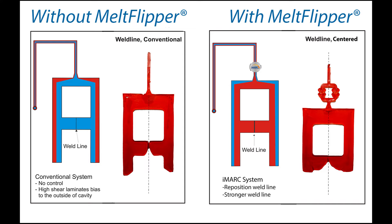Now if you think about your goal in creating a weld line — the hotter the melt of that plastic coming together to form that weld line, the longer the time for the molecular chains to entangle, in turn creating a less visible and stronger weld line.